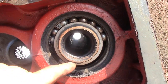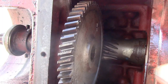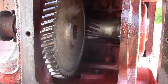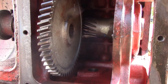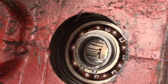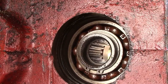There's another really big lock ring in here and we can drive that shaft out the back. This is the PTO driven gear — the front half of the PTO shaft splines into here, and further back in the differential case this is where the sliding gear is that locks the PTO output shaft in gear. This driven gear has to be driven back out of its bearing. The lock ring comes off, that gear gets driven back out of its bearing, and then with the lock ring out of the other shaft, it can go out to the back.